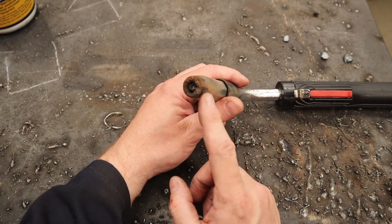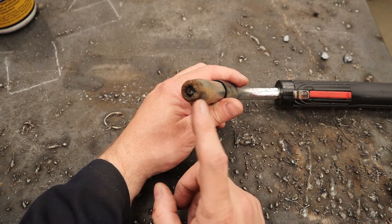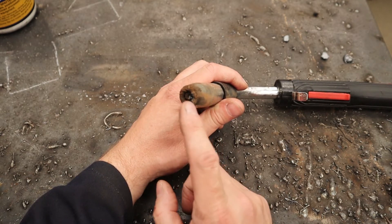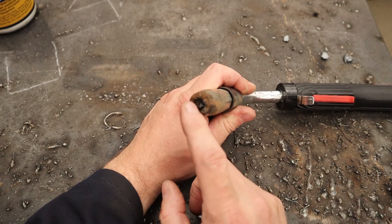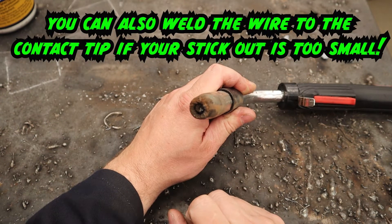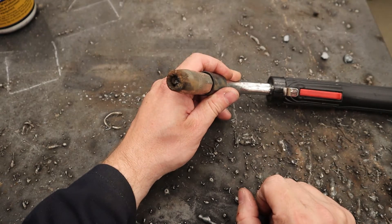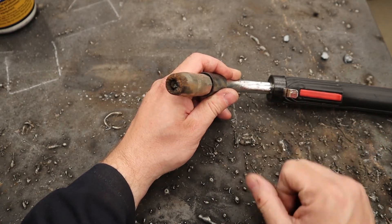The fourth reason — and really quite common — is welding for hours or days without cleaning your nozzle, or having incorrect settings that cause excessive spatter building up inside. Eventually that spatter will connect and weld the electrode wire right to the contact tip, which stops the wire from moving. But you're still pushing the button asking the feed rollers to drive the wire, and after a couple of seconds it backs up into a bird's nest.